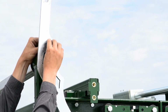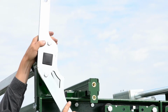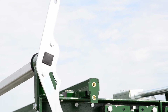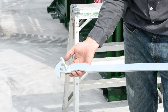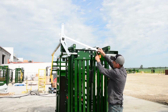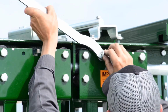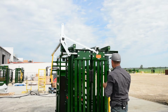These are 1/2 inch bolts, 3/4 inch wrench. Put them on like this. So now that's complete. Now your next step is to put the hammers on. I'll start with the long hammer first. I usually prep my hammer like that, put my 1/2 inch bolt on and the washer next to it there. Then make sure to mount this on the hole that's toward the center of the head gate. Like that. Then just thumb on your 1/2 inch nut.